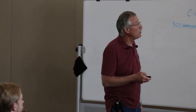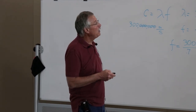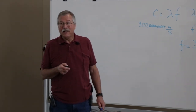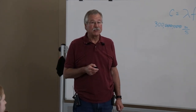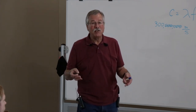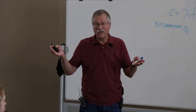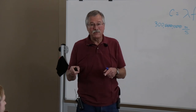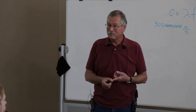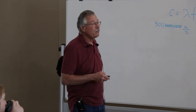But they're given much more space. The reason that FM is superior to AM is because lightning, electric fences, neon signs, and car ignition systems radiate interference, noise. Noise is amplitude modulated for the most part. If you have a receiver that is sensitive to amplitude modulation, you hear this stuff. If you have a radio that's only sensitive to changes in frequency, it can ignore static, lightning discharges, man-made noises, those kinds of things. So FM is superior in that way.